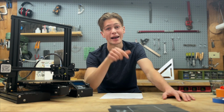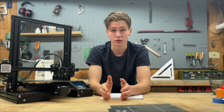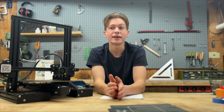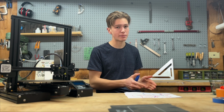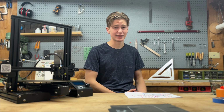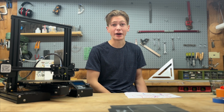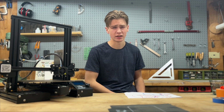Sort of similar to adding the brims in your 3D software, another thing that you can do is add a very, very small slant, does not need to be big at all, to the bottom of your prints. And that doesn't prevent the elephant's foot, but it counteracts it. Honestly, it looks way better to have a slant in the bottom of your print. It's actually a design technique that a lot of people use even when there is no threat like elephant's foot, and it'll still look better than it would have beforehand. So don't feel like this is hurting your print, because it's not.